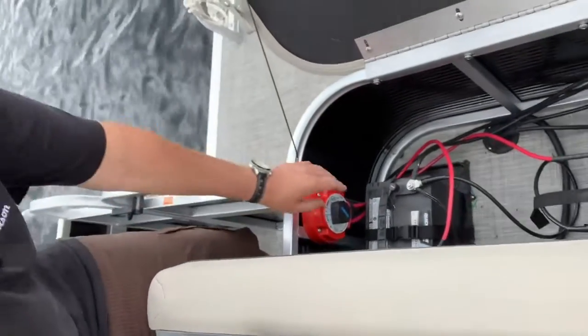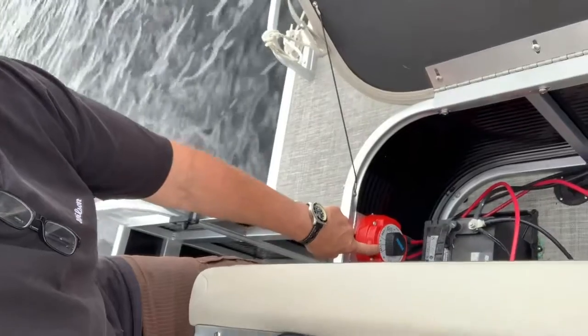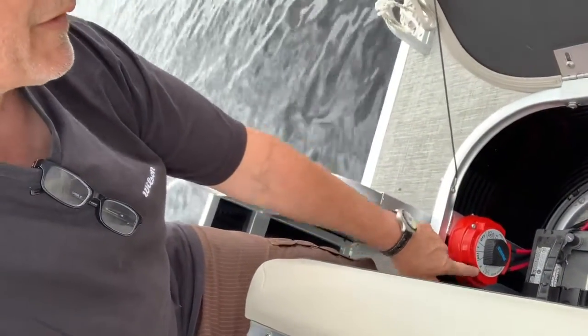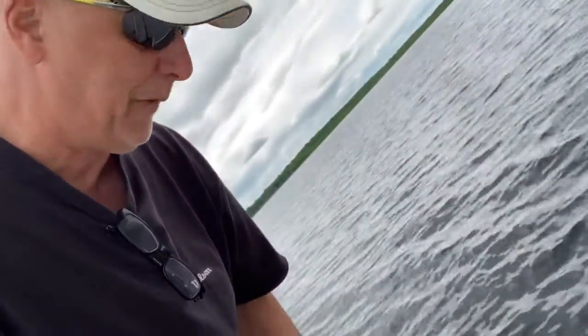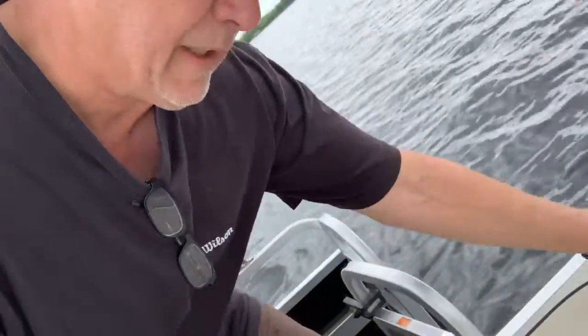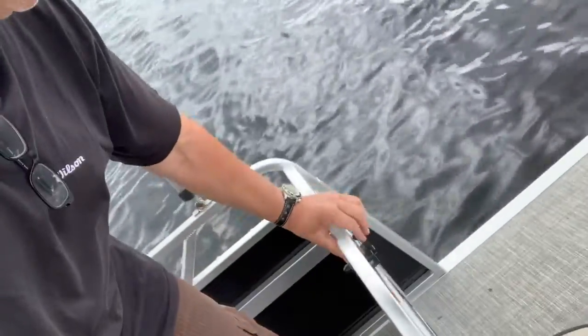Let's look at the back of the boat. Here's where the batteries are — I've got dual batteries. There's a big battery switch here: put it on 'two' when you're running the boat, put it on 'all' to charge both batteries. When I'm on the radio I put it on 'two' so I'm only draining one battery in case I need to start the boat.